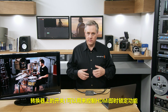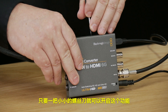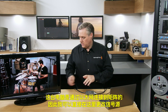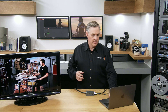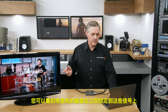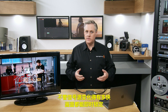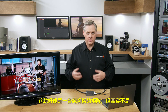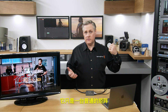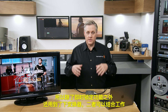HDMI instant lock will fix that. Switch one on the converter is for HDMI instant lock. I'll take a small screwdriver and set HDMI instant lock on. Now, as I change the sources using the Ethernet-connected router software, the television instantly locks to those sources. No matter how fast I change the sources, the image is instantly locked — it's very much like a clean switch router. All the sources are Ultra HD, so the down converter is working together with instant lock simultaneously.